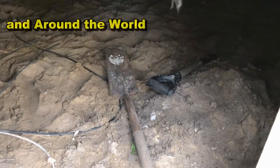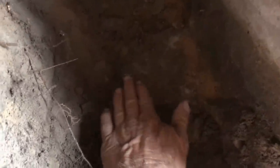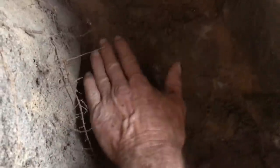We're going to dig a trench right down to the footer. Let's see if you can see it here. Let your eyes adjust. It's kind of dark, but yeah. Can you see? There's the footer. We're going to dig a hole right beside it, a trench, a couple of inches below that footer, put gravel there, and then our pipe, and then more gravel to cover the area.